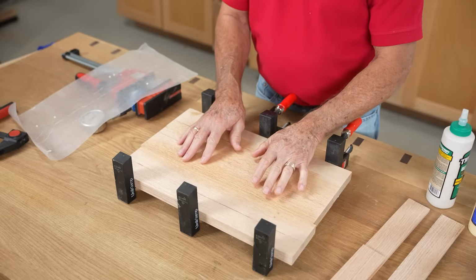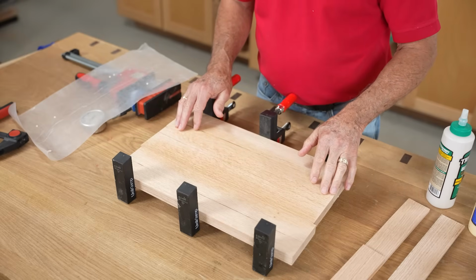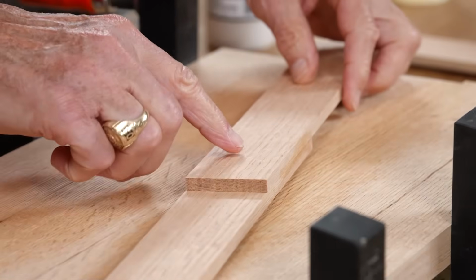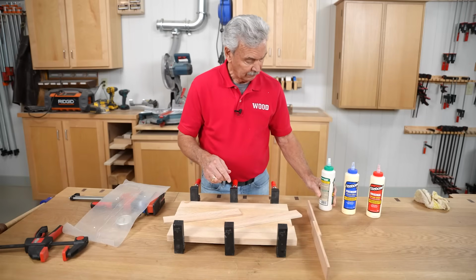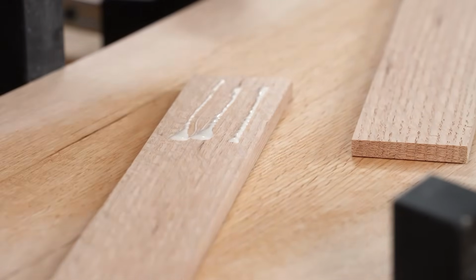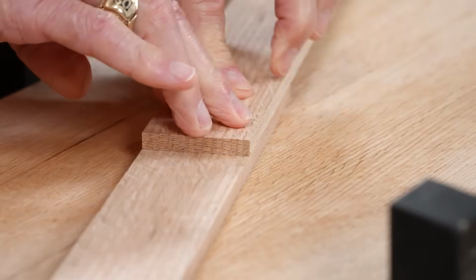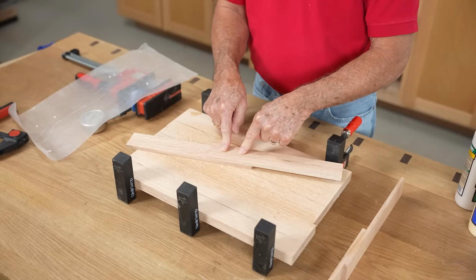All I'm trying to do in this project is recreate a good bond that sits together well with relatively minimal pressure. A lot of that comes from one of the earlier techniques in putting joints together, and this is called a rub joint. A little bit of glue is put on the joint and then rubbed and held, and I've got a piece to show you. So if I put just a little bit of glue on here, and I rub this joint together, I'm just going to hold it for a few minutes. You notice that it's just the rubbing and actually finger pressure that's holding it.